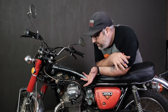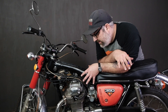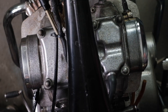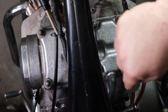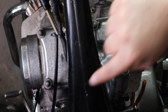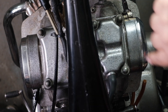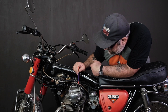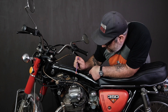Another place where torque values are extremely important is actual engine part assembly. Probably the biggest and most important one is the head gasket torque, or head bolt torque. On this 350 we actually have nuts — eight of them running across the top of the valve cover, sandwiching the whole assembly together. Because there are multiple fasteners all working together, there's a slightly different approach to torquing this, and we'll have another video — check the link in the top corner — covering how to torque multiple bolts in sequence at multiple torque stage values.